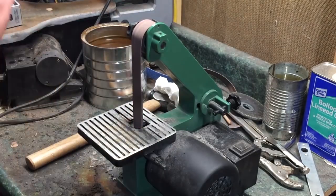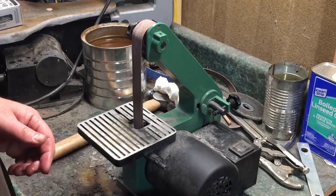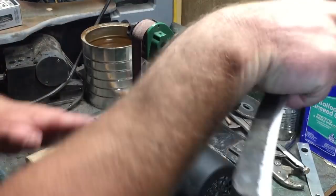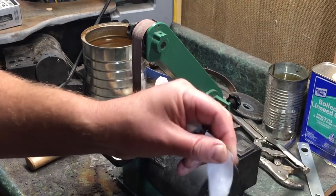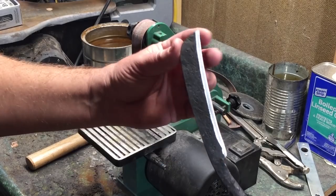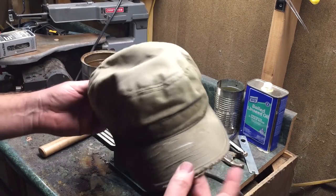To actually sharpen the edge I used an old, very worn 120-grit belt. I like the look of this — it seems like it has good balance. You'll see me having a little fun with it, but I am not by any means skilled with a karambit. About the only thing I really know is that if you don't know what you're doing, it's really easy to hurt yourself — I'm definitely keeping that blade away from my wrist. I did the paper test but could only find a few little scraps of paper — I guess I went a little nuts yesterday with the chef's knife. But it cuts the paper I had, and with that I'm going to call it a day. It was a fun project. Also, I think my hat is pretty much completely destroyed — definitely time to pick up a new one.